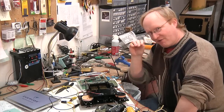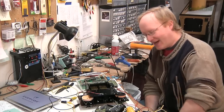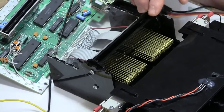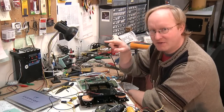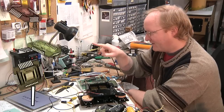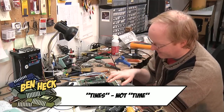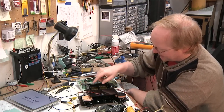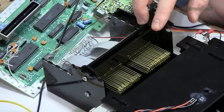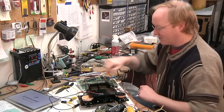In our last episode, we were trying to make the grabbers to hold onto the cartridge, and it was a pain in the butt. I finally did come up with a solution. Here's the slot-loading mechanism that you've already seen, and here's the new grabber system for the cartridge. The problem before was we had those short little connections and they couldn't flex very much. If the tines are longer, they can all have more flexibility, allowing them to compensate for the other ones not being exactly right. I made this jig which has a top and bottom for the cartridge and it's geared along with the servo. It has an open position, and then it bites down on the cartridge — the tines are all flexible, and because they're longer, they have more flex.